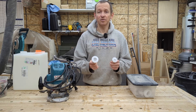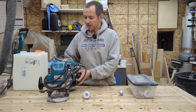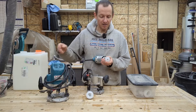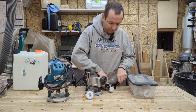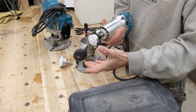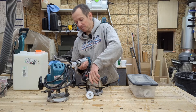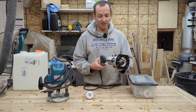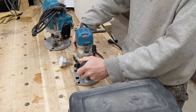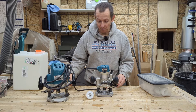I can get through my whole installation just using these two sizes. What I really like is that if you watch other spin welding videos, what people will do is take a router, remove this plunge base, and just chuck the fitting up bare and plunge it into the hole with no plunge collar or base on the router. I have tried this, and I'll demonstrate some footage toward the end of the video. But I think it is a much more relaxing and stable process if you actually use a plunge base on your router — once clicked on, you can line it up on the tank and just plunge it wherever you need.